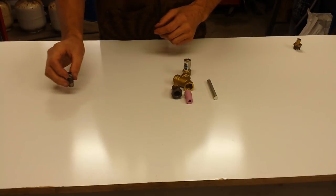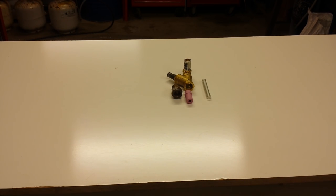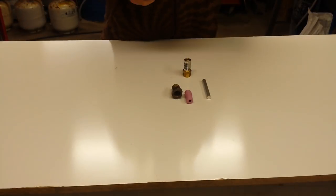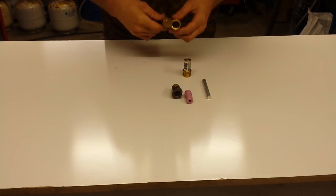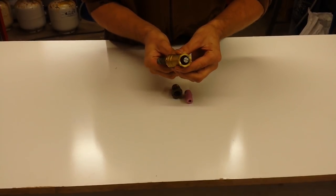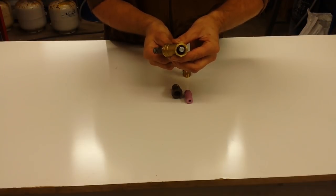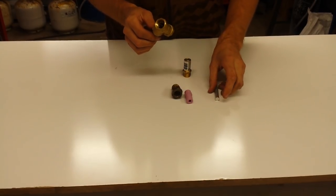I've gone and done that now. If you look through that one - I did it really rough by file, I had put it in the lathe but my boring bar setup has got a broken tip in it, so not ideal. But you can see there's a lot more movement in there and I can actually get that central. That's the essential part - it has to be central within that nozzle because it's going to have to line up with your ceramic tip in the end.